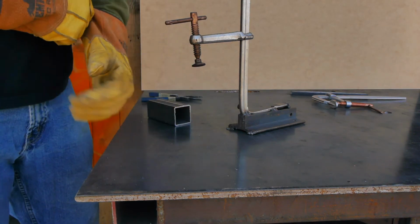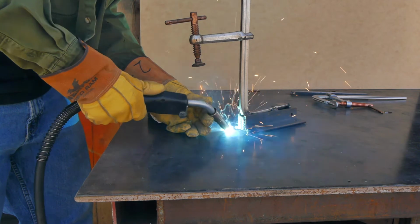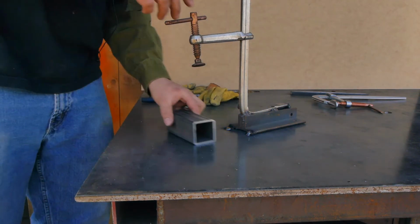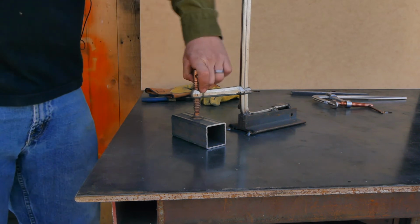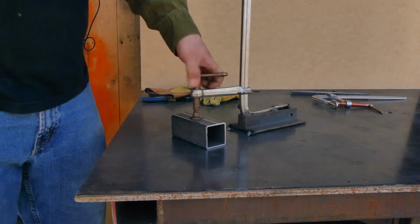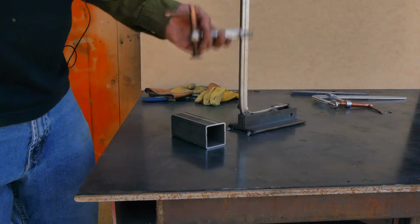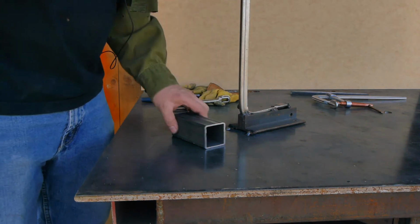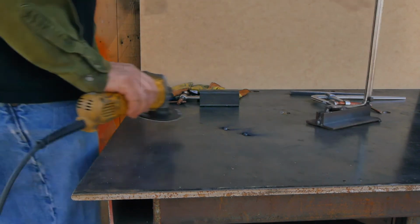Well, the first thing you do is position the clamp and tack it down. With this clamp, I always end up putting a tack on each corner in the front. I could definitely get away with one tack. It's pretty amazing how much tension these tacks can hold. So when you're all done, you release the clamp, pull the clamp towards you to break the tacks.